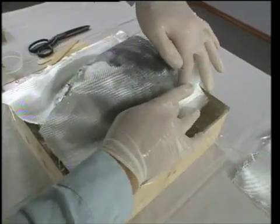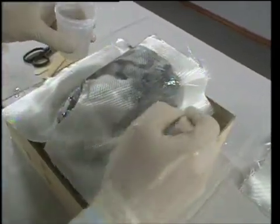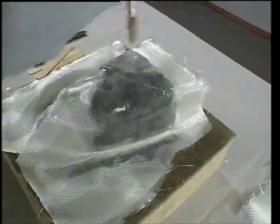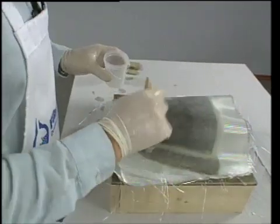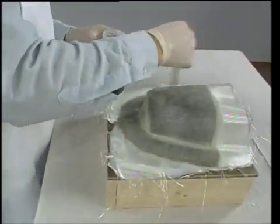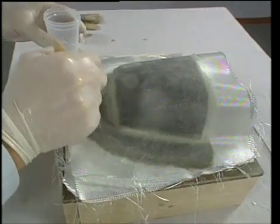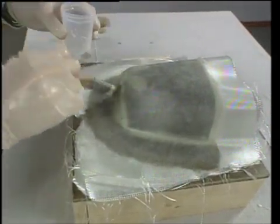We have our initial layers on our mold. It takes quite a bit more resin now to wet out, as the fabric absorbs the resin at a faster rate — it means that there is more fabric to absorb. The final coat of fabric is on; just blotting it out, making sure that it's completely saturated and wetted out all the way around the perimeter, with no dry spots anywhere on the mold.